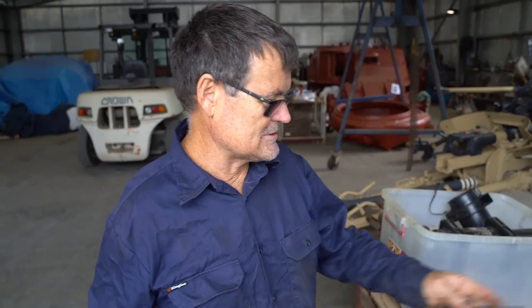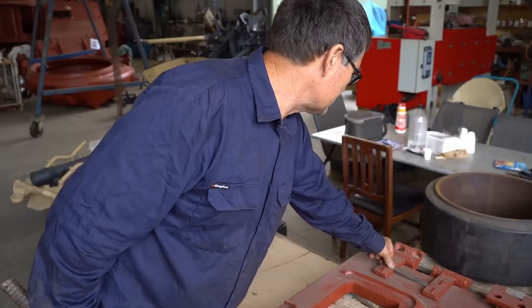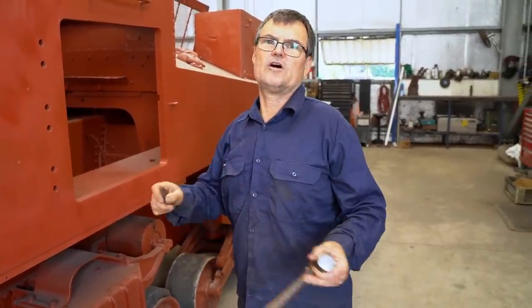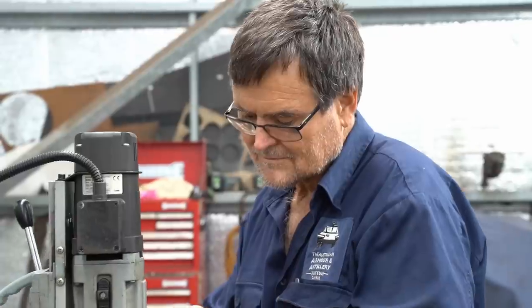What we've also found out is on this original door, the spacings for the hinges are different - that's at 145mm and that's at 125mm. But on our hull the spacings are even at 110mm. That doesn't match this door because they have different spacings, so either they've modified them across different models. We're going to drill new holes to match the spacings we have here. It's not ideal, but as always it's better to use or modify original parts than to fabricate new ones where possible.